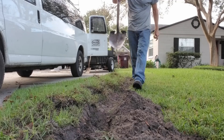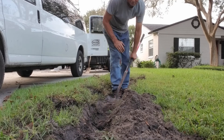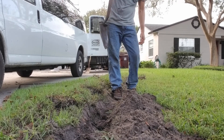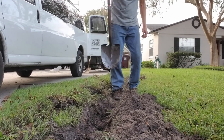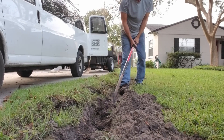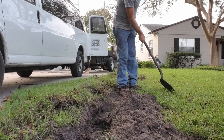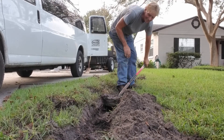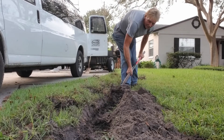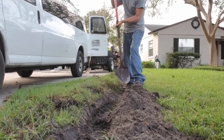When you come back, you always work backwards. Take out your shovel and shovel deep. Remember, we're running inch-and-a-half pipe through here, so it doesn't have to be really deep — it's under pressure. A lot of tree roots, but the shovel will cut them. Just make it a good slice and it cuts right through. Use your body weight, come back, clean out the trench. Remember to set your dirt beside the trench, not out away from it — it's hard to put back. It's easy to dig the trench; it's hard to put it back together.